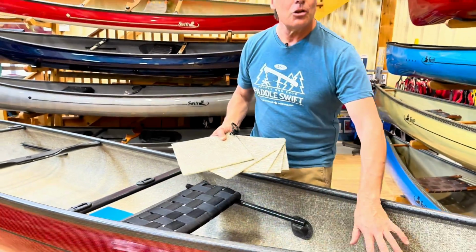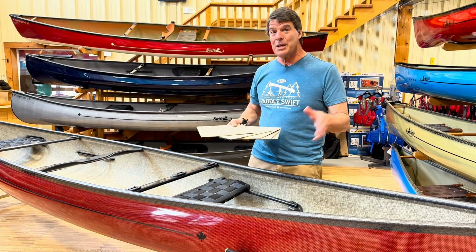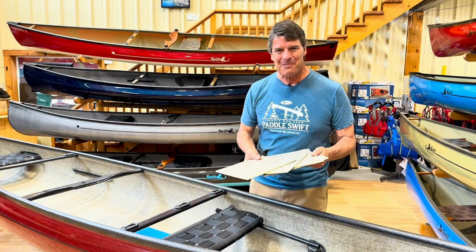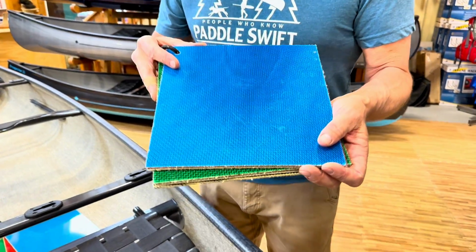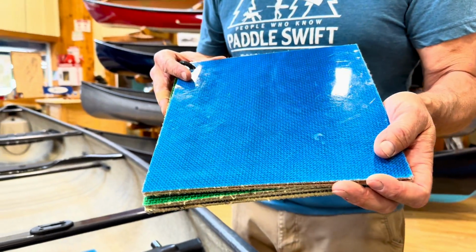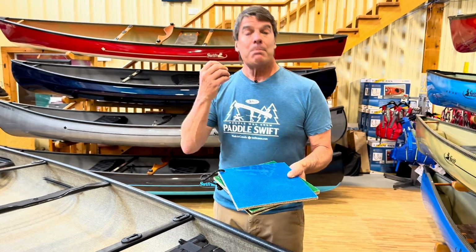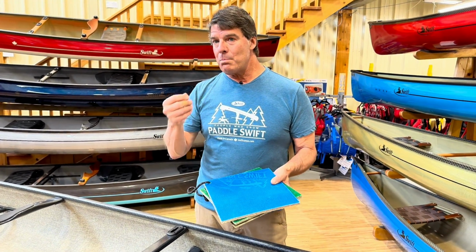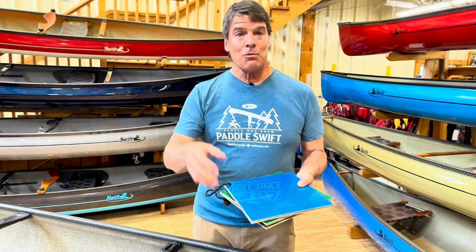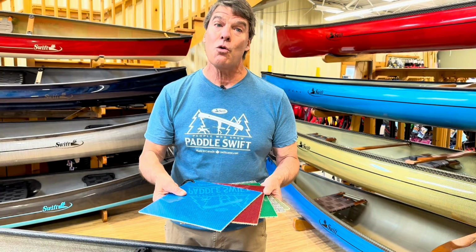It hides the look of the dirt. If you like to do a lot of fishing, it hides the residue that you might have from fish flopping around in the boat. Now the Expedition Kevlar laminate itself is 4 full layers of cloth plus partial pieces in the ends and along the keel in selective spots. And it's got Basalt Negra layers, it's got Kevlar layers, it's got the commingle fiber on it, and depending what outside finish, you either get one of the polyester cloths or one of these other cool finishes.